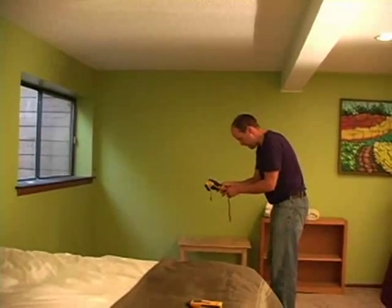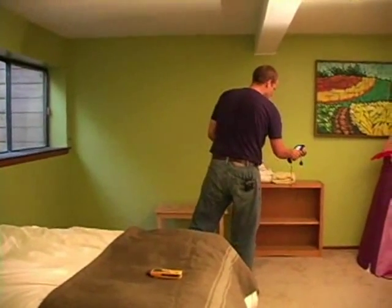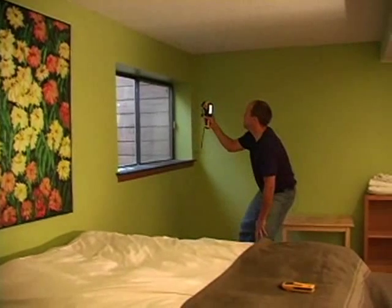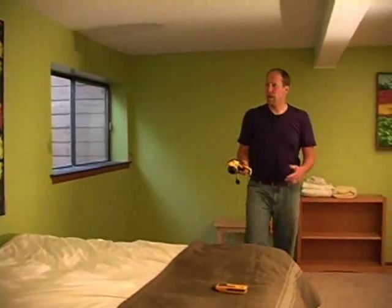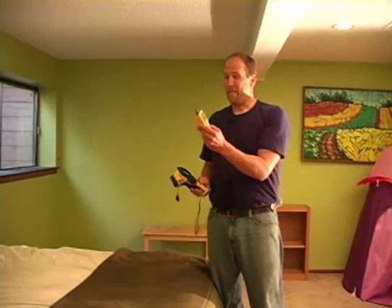This is the window well area. Nothing abnormal at all — looking for cool spots, as water penetration usually appears cool, like a black area. In my other areas of concern around the window, I really don't see anything. Didn't see anything visually, don't see anything with the infrared. So I'm not going to confirm anything with my moisture meter here. That was interesting — let's go back upstairs and look at the deck area to figure out what's causing this water penetration problem that I really didn't see with my eyes but picked up quickly with the infrared and confirmed with the moisture meter.